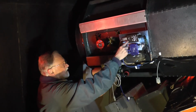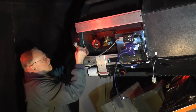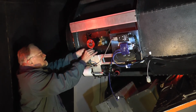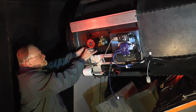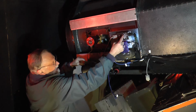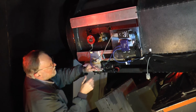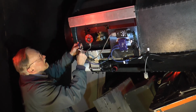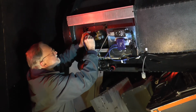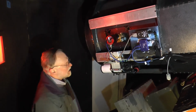So this is the controller that drives this focus motor, and it gets connected up with this old DB9, I think it is, plug that screws in to the focus motor there. So that will let you control the focus motor up here with these 2 buttons. That'll make them move in and out, or from the computer in the closet over the USB cable. And then finally, but last and not least, obviously, is the camera has to get hooked up. There's a USB plug for the signal and a 12-volt plug that drives the cooling engine in the camera.